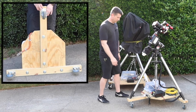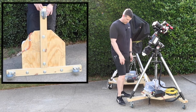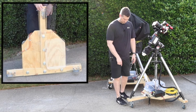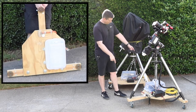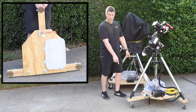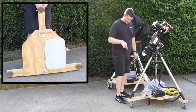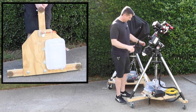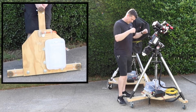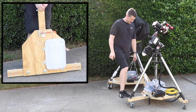I'll try to draw this out and pop it on the screen for you. To make sure the tripod legs don't fall off, I took that same paddle bit and, once I sat the mount down on top, I marked where the legs were going to fall. Then I took the mount back off and just set the paddle bit in about a half inch, popping some small holes in there so it doesn't move — the legs are sitting down inside a hole.